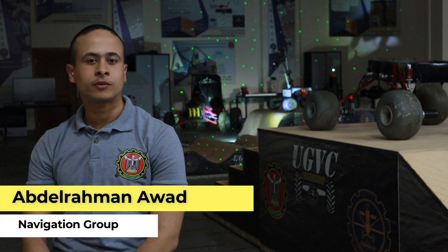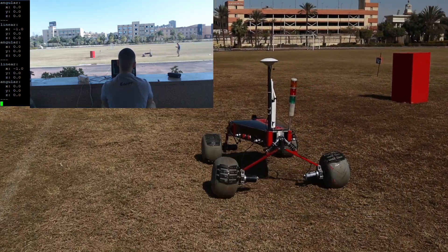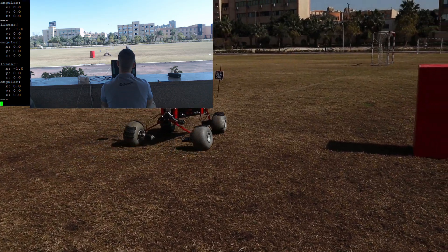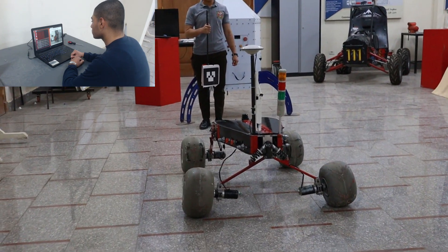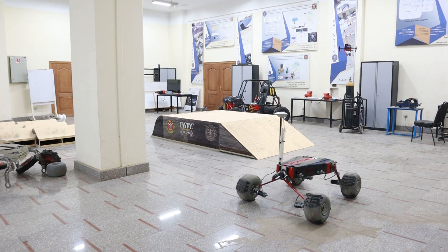For the autonomy task, we upgraded our system to operate with ROS2, with a localization system done through sensor fusion between LIDAR, GPS, VectorNav, and stereo vision, where obstacles are detected using LIDAR. The rover is then visualized on Google Maps to ensure the rover maintains its best path. We calibrated our cameras for AR tag detection, with VectorNav to determine odometry and path planning. We also started using a drone in indoor training, driving it manually by giving coordinates to take off and land on the rover.